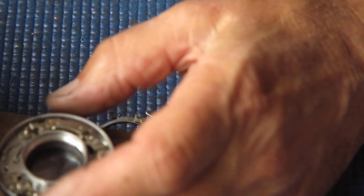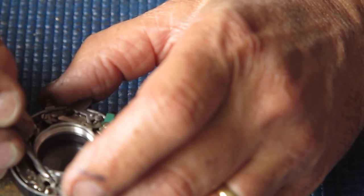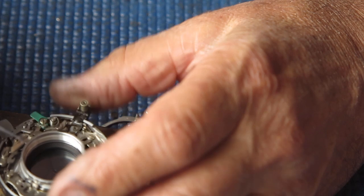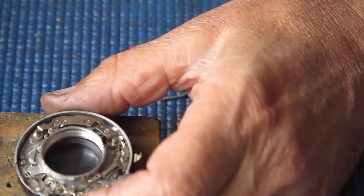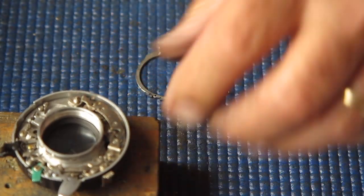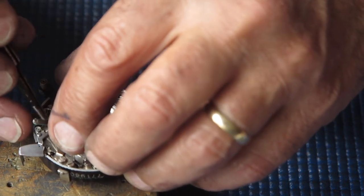And in the shutter itself, I'll put some on this lever, on the retard gear train, some on that lever that operates the pallets, some here and here. That's it. So I'm going to cock that shutter by pulling that lever across. Drop the spring down into that gap. That B lever was blocking it, of course.